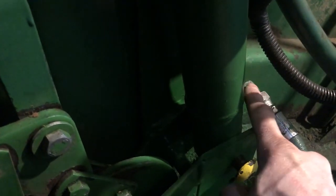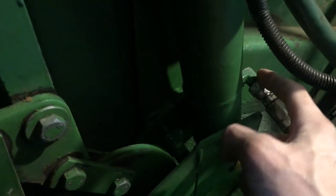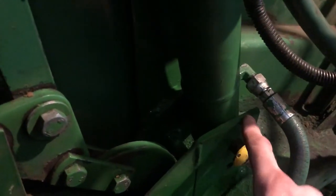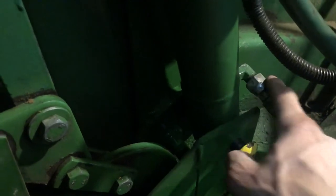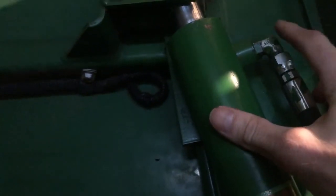Make sure the hydraulic hose connection is right. When they rebuilt this thing they had the hydraulic connection pointing more down, and I had to pull it up because it would hit this bracket — this hose would hit the bracket, so be mindful of where you have that lined up. They also had this one pointing towards me but it has to point down because this hose is not long enough. Just be mindful of the location for the connections.